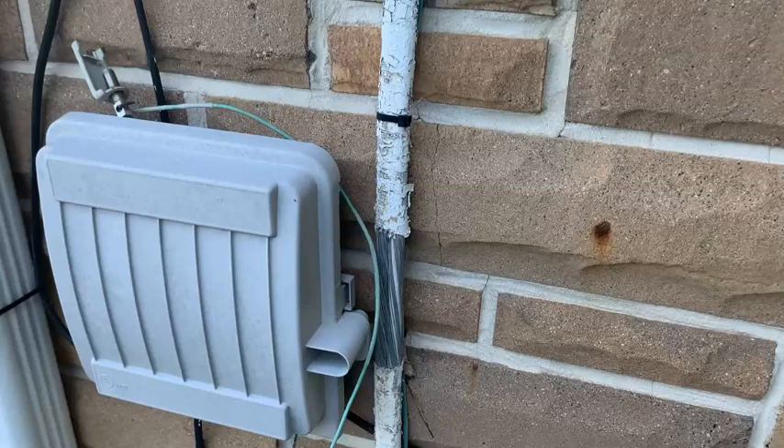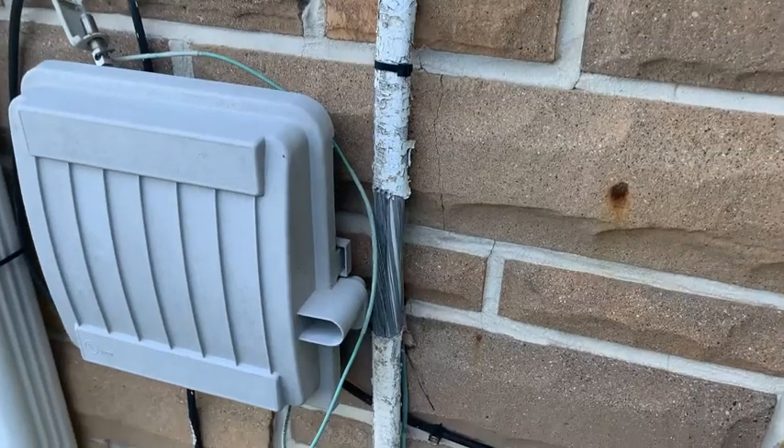Outer sheathing worn away, like I say. And what's going to end up happening — water gets into this area, soaks through the line. You'll actually see rust, and sometimes you'll actually get water inside the electrical panel in some situations.